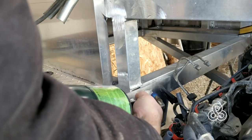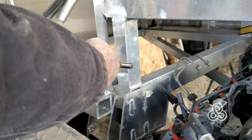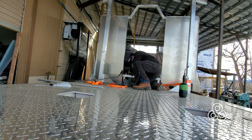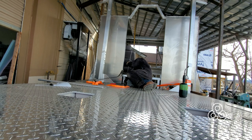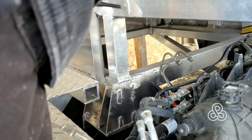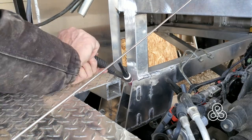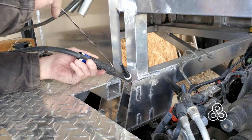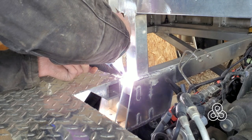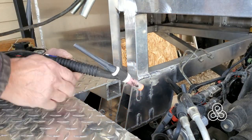It's been pretty cold around here, so I'm going to preheat this whole thing with a torch, because it takes a long time for the TIG welder to put enough power through all this aluminum to get it up to temperature to weld well. You'll also notice I'm laying down with one arm around the chassis, one arm feeding rod through a hole, and running the controller with my knee. This is real-world welding — nothing like what you see on the internet working on a bench with a rotating device. In the real world you're contorting yourself into odd positions, even bending your filler rod to feed it back at an angle you just can't hold your arm into. Whatever it takes to get it done.